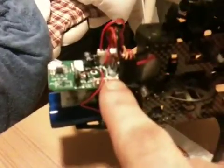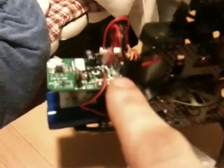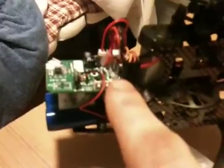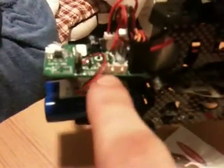There are 3 terminals just here on the board. It'll be in this first terminal here. You can see up here the plug is just tucked away there. All I've done is wrap the plug round up here, tucked it away, no messing about, sorted out of the way. There will be a bit of glue on the plug. Like I say, get a sharp knife, very carefully. Don't cut yourself, don't slip on the board, don't break it. Take your time, pick the glue away, and you can take the plug out. As simple as that. And then that light is disconnected. The other 2 terminals are the same thing if you wanted extra lights. But like I said, I'm not into flashing lights. I'd rather have that little bit more flight time.